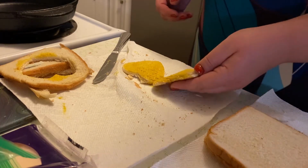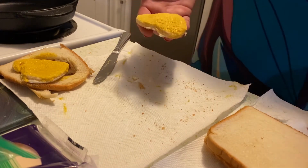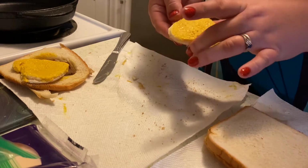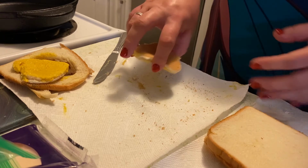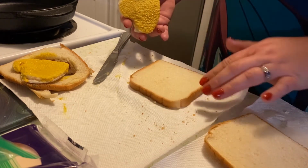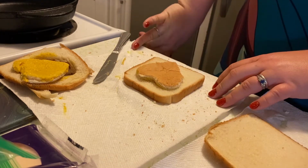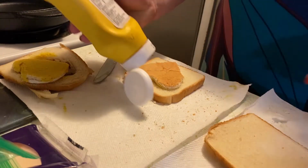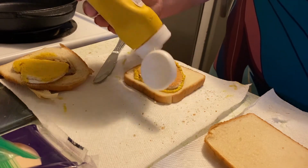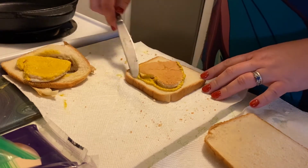Okay, so when we make our sandwich, we're going to have our top layer with solder flowed across the underside, and we're going to cut it out into exactly what we need. Then we're going to take our bottom layer, put the top layer on, add a little extra solder for insurance, and solder it together like this.